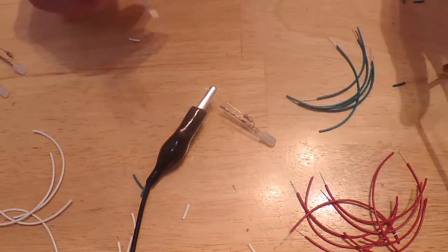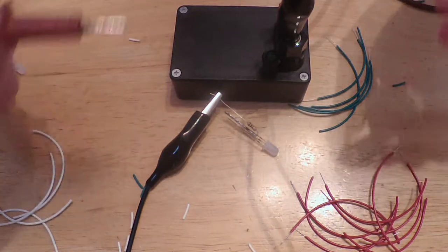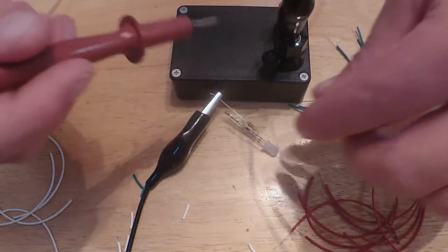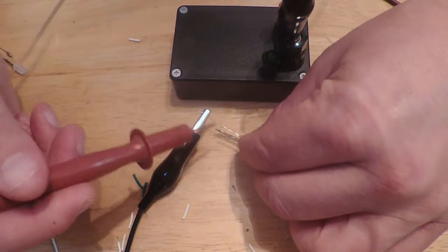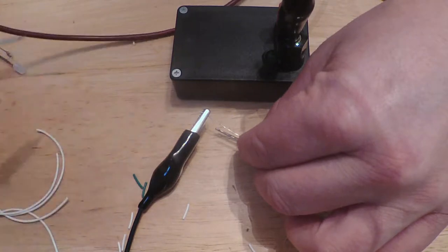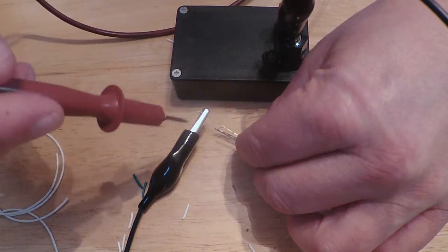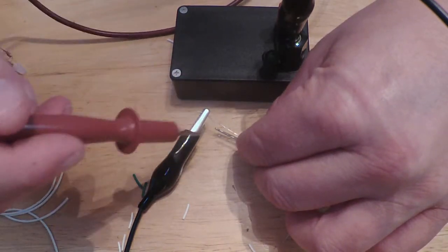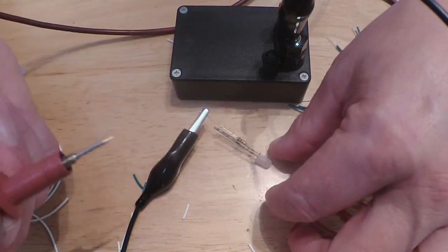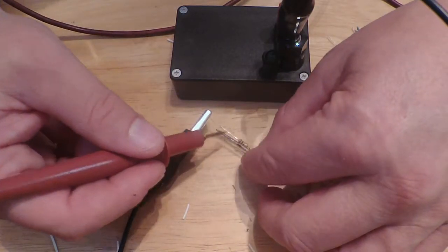Okay, so we're going to do a test, and I've got my little box that I built, and it's got an LED right here, and this is the negative, and this is the positive. The firing indication will go out on the negative side. So this is the negative loop. This will go out down to the rail or slot, depending on how I'm rigged. And when the circuit is complete with the igniter, this LED will light red if we're in firing status, and if we're in load status, it'll be green. So we're going to go ahead and... Why am I not working?